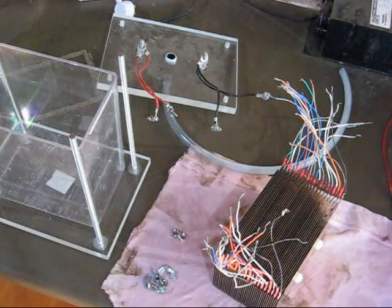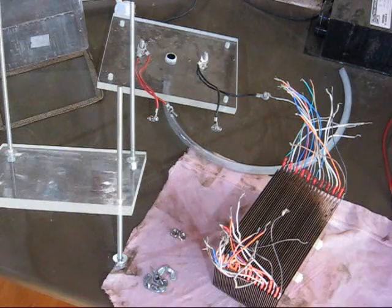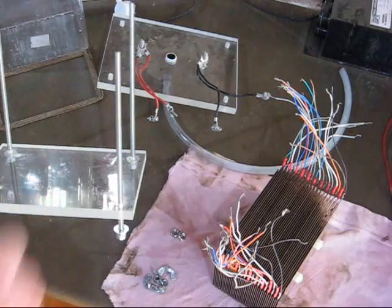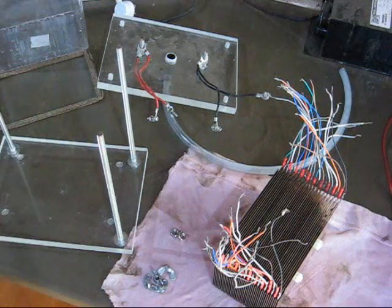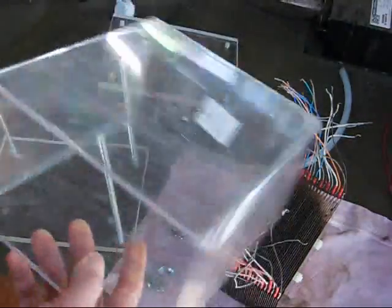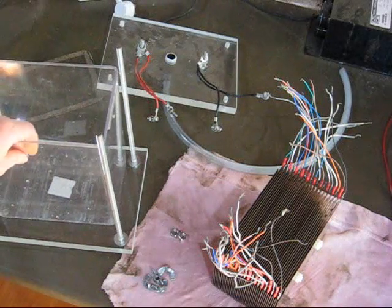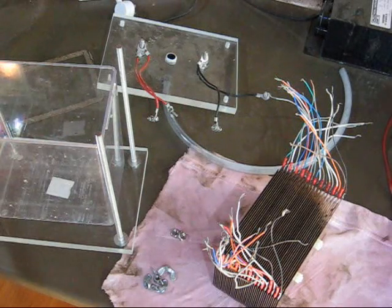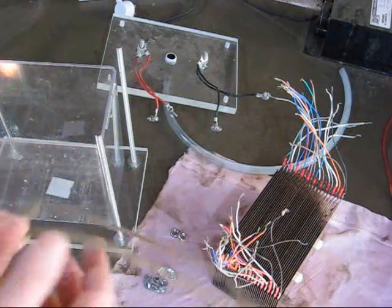So how do we seal it all? First we've got a 15 millimeter acrylic plate — very simple, with four holes to accommodate those steel rods; just steel rods, the cheaper kind. Then we've got Tupperware — really simple, whatever you can buy in the shop. I cut the plates to suit that Tupperware. Then we've got a cork rubber seal; they are quite cheap and easy to find in a car shop.